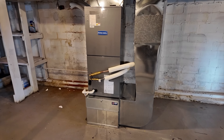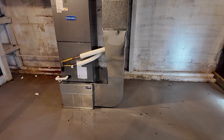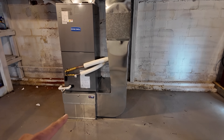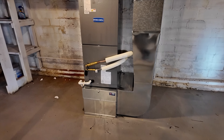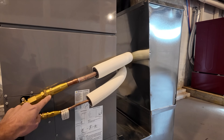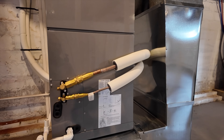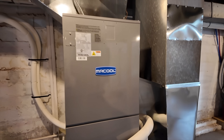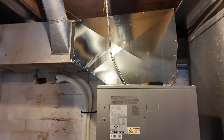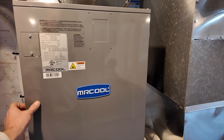Here is the indoor unit for the 36,000 BTU Universal Hyperheat — the latest generation. I swapped out the old oil burner, so I had to do some modifications for the cold air return that comes down into this filter box, which also serves as a stand for the unit. The flow goes up and through the unit. The key to these DIY systems are the pre-charged lines with vacuums in them — install everything leak-free, open your two valves on both the indoor and outdoor unit, and you can get up and running as a DIY kit without needing an HVAC tech.